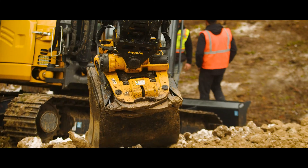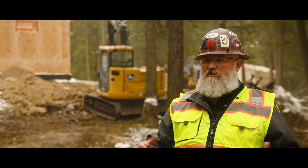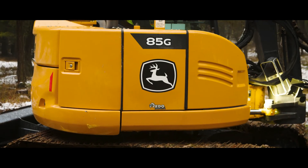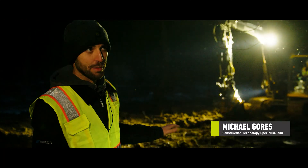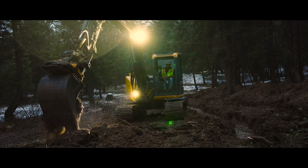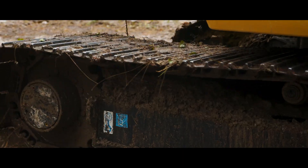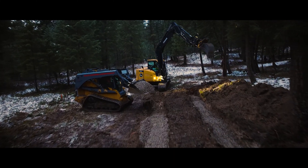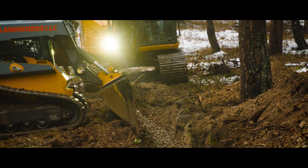There's a sensor inside the rotator that works with MC Mobile, so you can see the angles of your bucket and the rotation. If your machine is sitting crooked and you're trying to dig a flat pad, you can see that you're at zero. We actually laid out a drain field here for the septic system, took that same tablet after laying it out using the rover pole, brought it into the machine, and he's currently digging out and backfilling with gravel all the septic lines — digging and backfilling all in a row, going down each line in one fluid motion versus digging and coming back with a guy in the trench running off a laser.